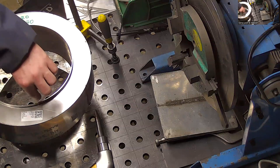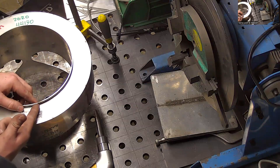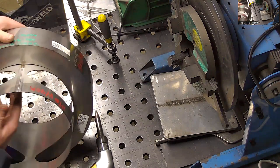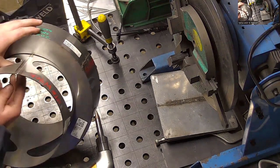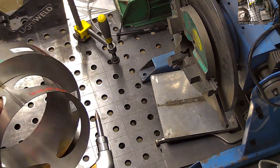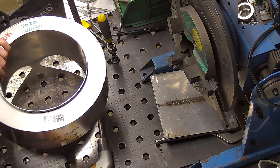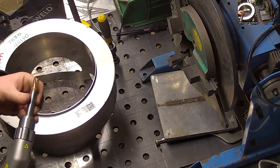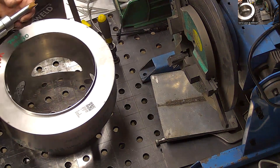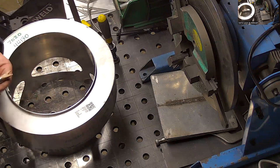I see. Yeah, there is a little bit of a gap. Again, I probably should have tried to sand that down a little bit right there, because it kind of holds it off with that weld bead. Nowhere near as bad as what I get. Okay, so I'll just use a clamp and do my best there. Okay, so let's do some tack welding. This tip is not really going to be the best for the inside corner, so I'll probably smooth it out.